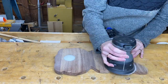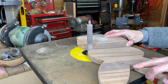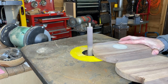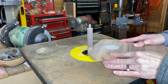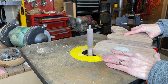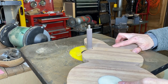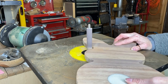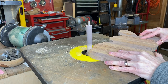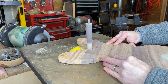I'm just doing a quick sand with 150 grit and then I'm moving on to the spindle sander. This is why I used the drill bit — I use the same drill bit size that my spindle sander has, so it helps me get into those areas and give a nice smooth sanding, a lot smoother than anything I could do by hand or with a hand sander. If you have a spindle sander, this is a great hack that makes things really easy. If you don't have one, you can always do those hard-to-reach areas by hand, or the curve may allow you to get in with a sander.